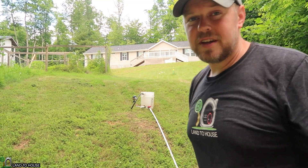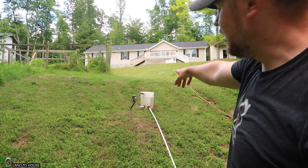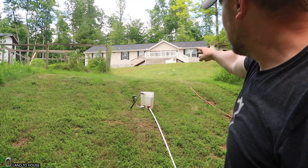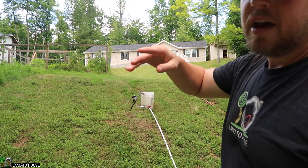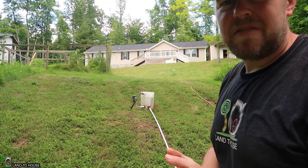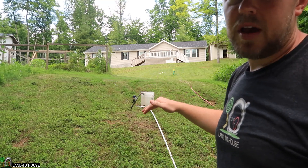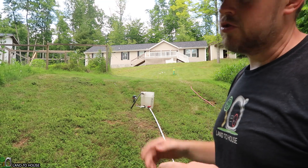The next thing I want to do for this chart is to stand at my bucket here and take the laser up to whatever my next point is going to be. I want to measure down, then step up until I have my marks. I think 20 feet will be our first mark. I'm not sure that's enough back pressure to keep the pump going, but at least we'll try at that point.